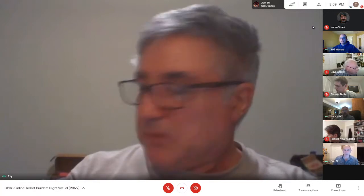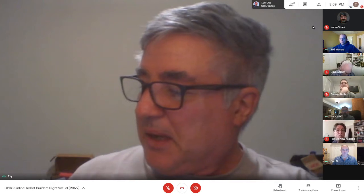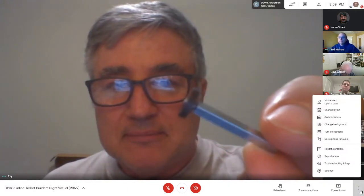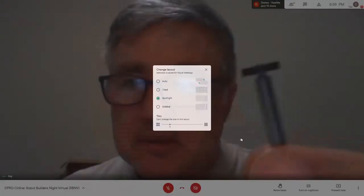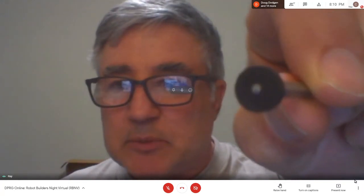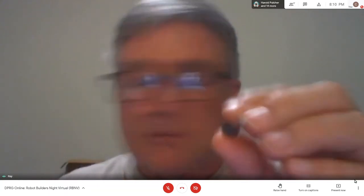Okay. Well, what I was working on, basically, it's a right angle gear motor. And this one actually had access to the back, and it has a 1/8 square recess or hole in the back of it. I had to turn a little magnet down to 2 millimeters, and then I could just push it in the back of the motor and on top of the encoder.